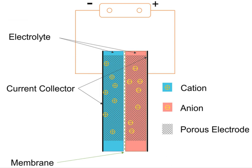Post-charge voltage relaxation. It has been noticed that after the EDLC experiences a charge or discharge, the voltage will drift over time, relaxing toward its previous voltage level. The observed relaxation can occur over several hours and is likely due to long diffusion time constants of the porous electrodes within the EDLC.